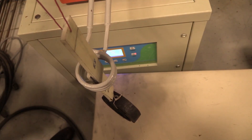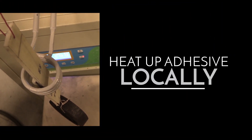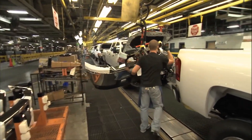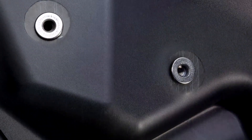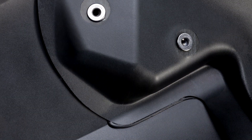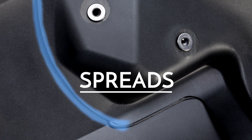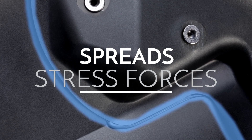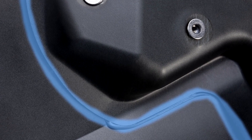Reversible bonding has three advantages. First, you only heat up the adhesive locally, not so much the adjacent materials. This saves energy, saves time setting the bond, and makes handling the parts easier during assembly. Second, old fasteners concentrate stress forces at bolts. An adhesive-bonded joint stretches the stress forces over the entire plane of the seam to reduce stress concentrations and increase strength.